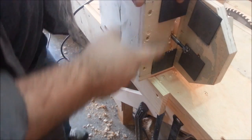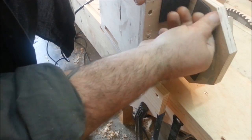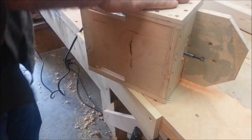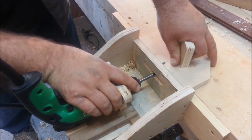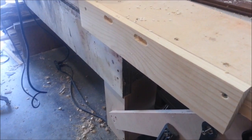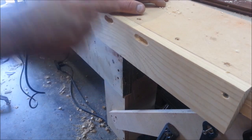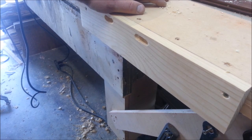I'm going to put some Fast Cap track pad on here to keep it from sliding back and forth — I think that's part of the problem. That's too soft and there's some bouncing around, so I'm going to take that off and try it again with the Forstner bit. That's a better cut, but I was having a hard time holding it in one position — it wanted to slide. I'm probably going to have to put something on there to keep it from sliding around. But ultimately that isn't too terrible of a cut.